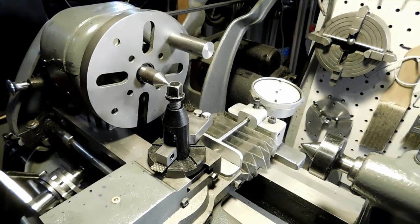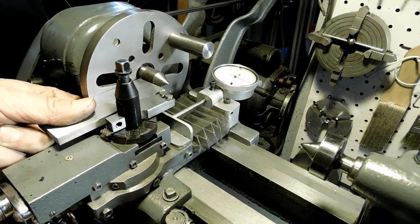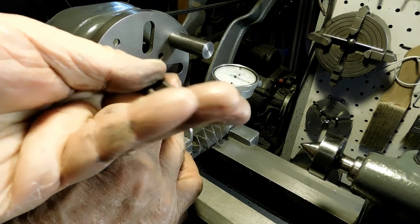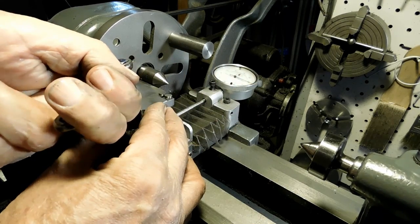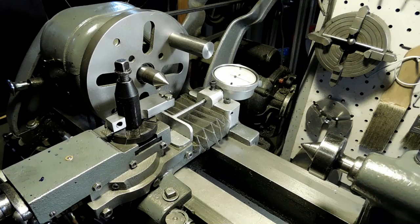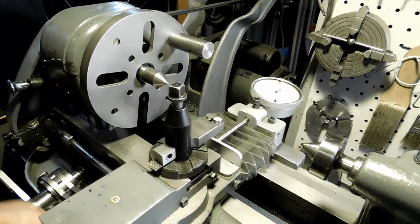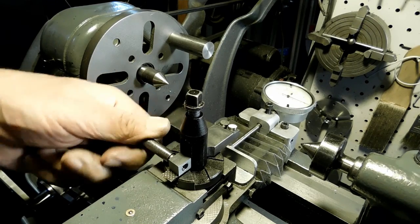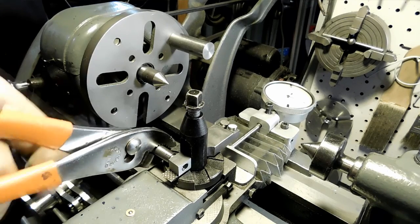And I use a set of adjustable parallels. I'll bring it in like that. And now we're perpendicular to the ways. And on our button tool, we've got to have this little dowel here. This will connect the button tool to the Eureka tool so that they work together.